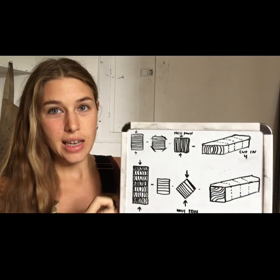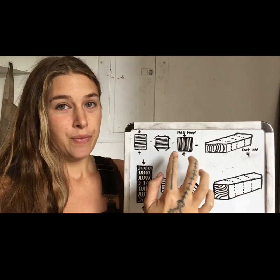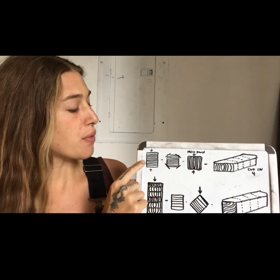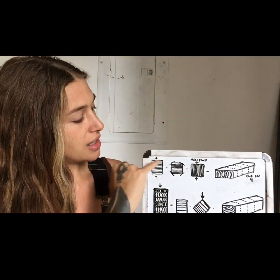For this Mosaic Billet, I need to start off with two separate billets. One of them is going to be what I call regular Cs, and the other one is going to be double Cs. I'm going to show how to make just a regular single C. I start off with usually 16 layers, because that's about half of your 48-inch long steel that I get from New Jersey Steel Baron. You're going to alternate the steel — 15N20, 1084, 15N20, et cetera.